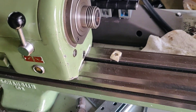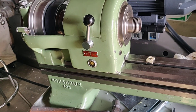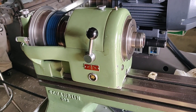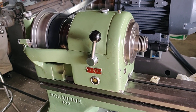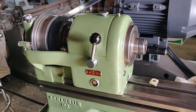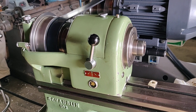After quite a while, I have this thing back in service — or in service for me, since I bought it not running. It was probably just as well that those bearings got changed out, because they had never been lubricated for at least a decade. They were bone dry and had almost like a black soot on them. They didn't seem completely horrible, but they weren't perfect. So I got a nice set of correct high-precision bearings.